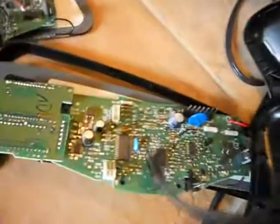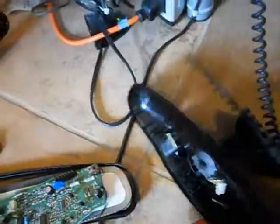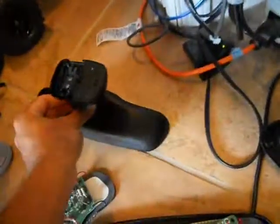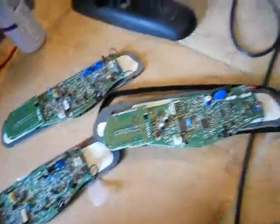It's pretty easy — you just gotta use a screwdriver and work around the edges very, very carefully, so you don't crack it like I did with this one. The first one I had, the 221, I cracked it over there and somewhere over here. So I did some nasty repairs in the bottom, and I also chewed up the bottom a little bit right there. I sanded it all down — that looks a hell of a lot better. I used 400 grit and then 2000. That's skipping a lot of grades, but it worked.